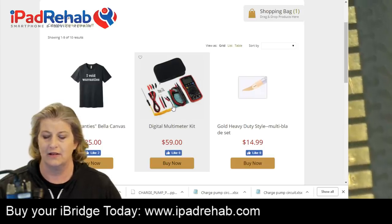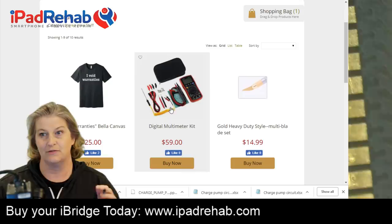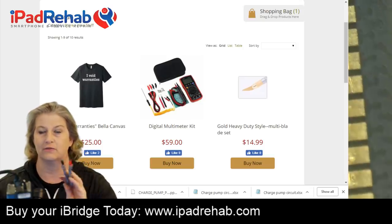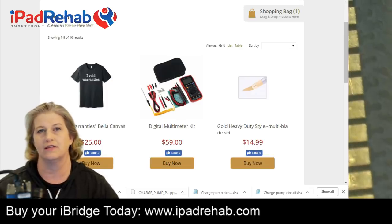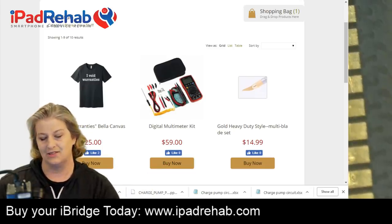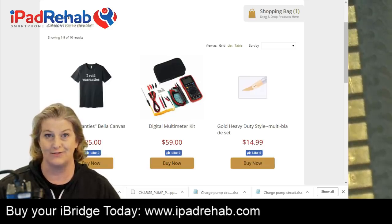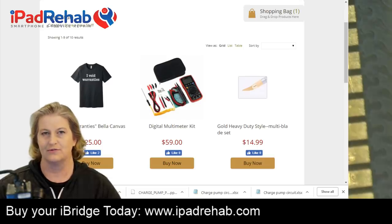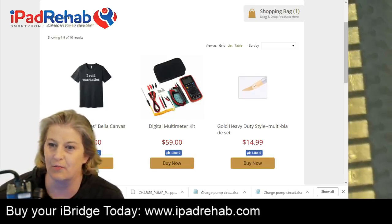I like this one because it's very bright. The stock leads that it comes with are acceptable. I've changed them out for our fine point leads, which you can also find on supply. The fine point leads are better, but the stock leads are thin enough that you can take most measurements. And this Chinese multimeter sometimes has measurements that are a perfect match to the ZXW diode mode readings on certain connectors. It's really nice when your multimeter is close to the Chinese readings you're comparing to. So that's why that one is our pick for multimeter.